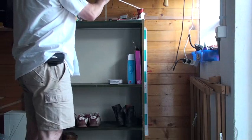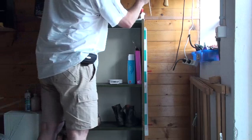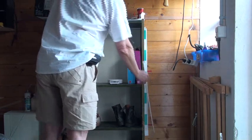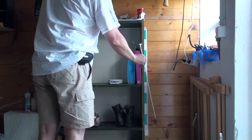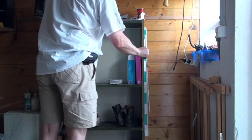Here above is the motor with a small sewing machine pulley. This is a line, very fine nylon, and here under is the weight — exactly 102.5 grams, exactly 1 newton.